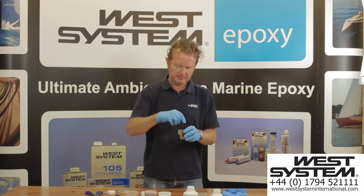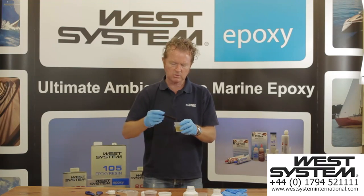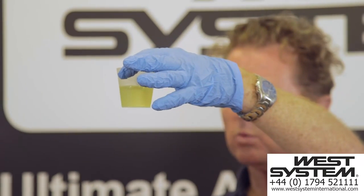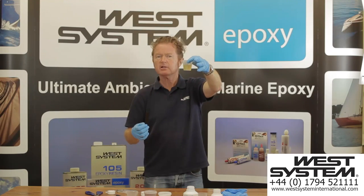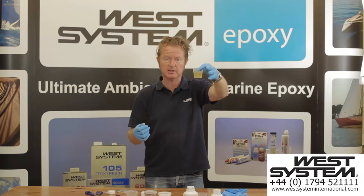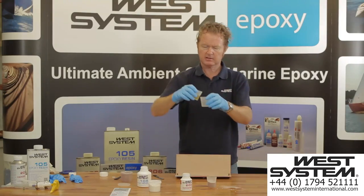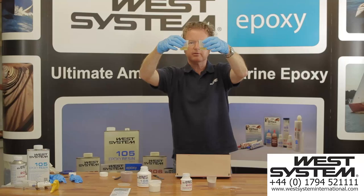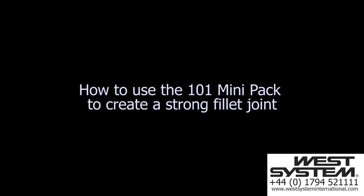Now I've mixed this up, and a really good question to ask is, how long will I have before this starts curing? Well, actually, this amount will start to gel, which is the onset of the full cure, in around about 15 to 20 minutes at about 20 to 22 degrees C. Now you can extend that working time by decanting the volume into another pot and creating two smaller volumes. A really good way of extending your working time by about 5 or 10 minutes.